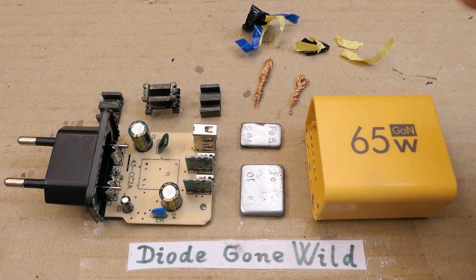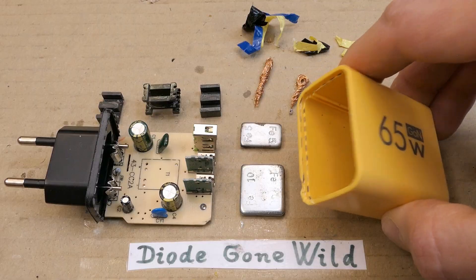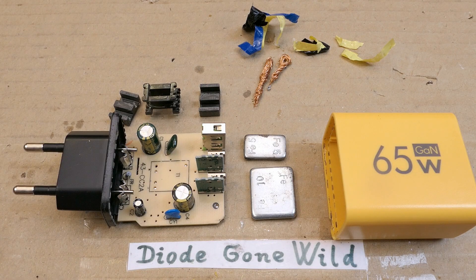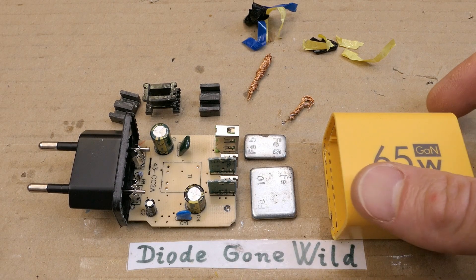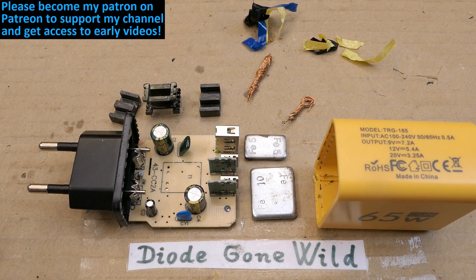So this thing is basically a 10W charger with weights inside to fake its mass — weights that could come off when dropped, or when the double-sided tape gets too hot or ages, and potentially fall in and short the output to mains. There is no interference suppression, safety isn't up to European standards, and the capacitor between primary and secondary side isn't a safety-rated one. Even though I've seen much worse, the 65W rating is absolutely fake, and so are the claimed output voltages. If you like my videos, please consider supporting my channel on Patreon or using the thanks button, and you can also subscribe. Big thanks to all who already support me.